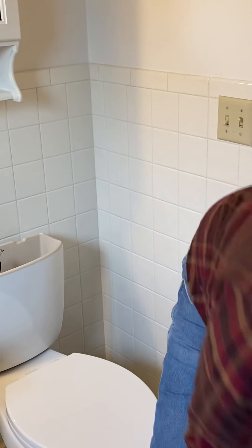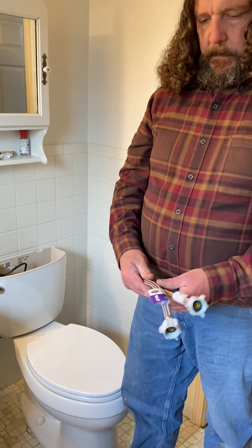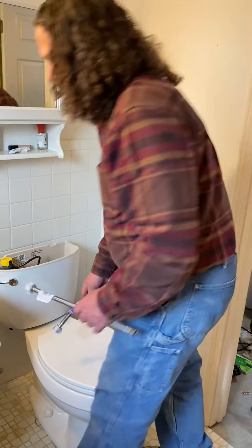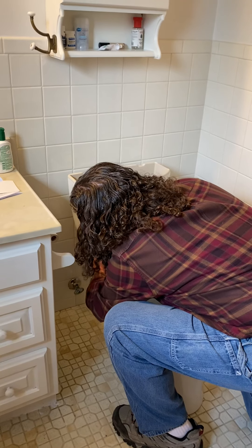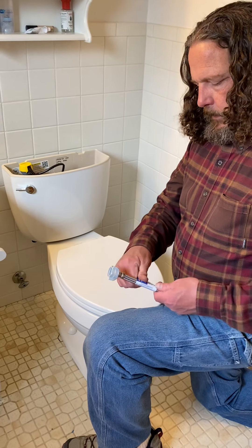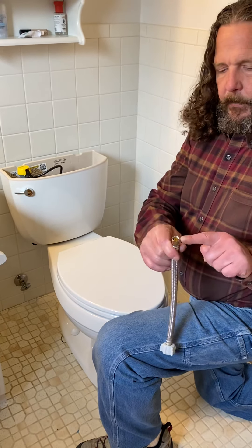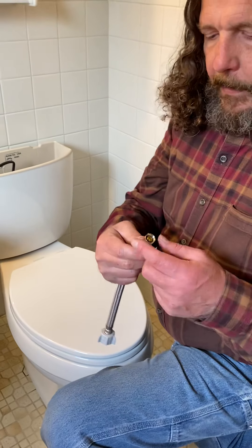So I had to run to the depot and get some water lines. If you remember, the water line at the beginning was one made for that toilet, so we just got ones that are flexible. I'm looking for one that's long enough — this one would do it nicely. That end is three-eighths. There's a toilet tank fitting — water lines inside a sink are different, they're like this on both ends. That's a compression fitting, so there's a washer built in there — you can see it, the black thing. So when I tighten this, as I tighten it, it seals itself. The same thing there — you can see the black washer. This one you tighten by hand, whereas this one gets tightened with a wrench.